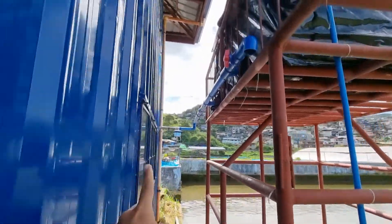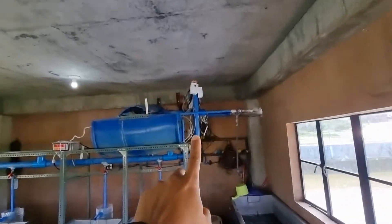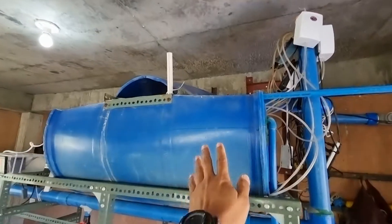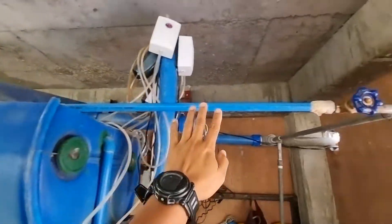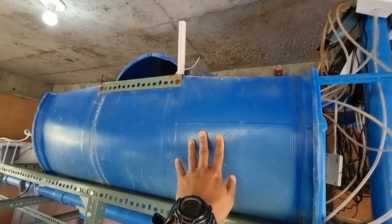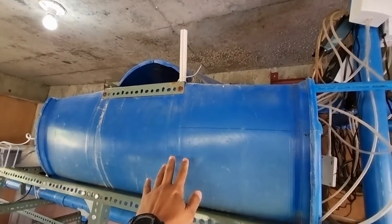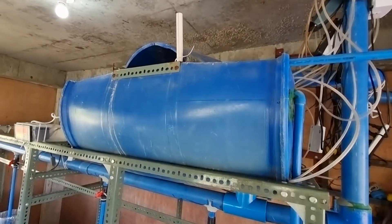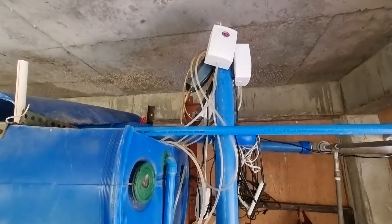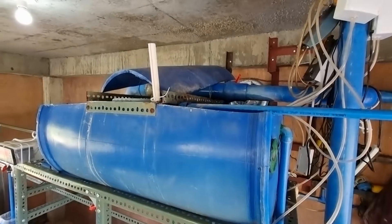The pipeline goes into the overhead smaller tank, providing another line for the water. We have a venturi here to increase aeration and add dissolved oxygen to the water. We also have aerators to further increase aeration and add more oxygen.